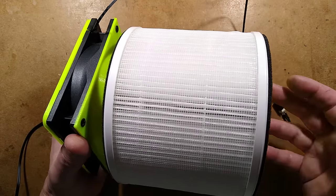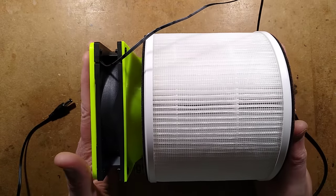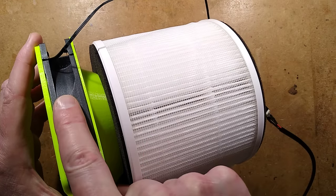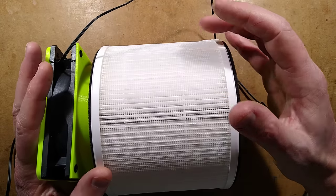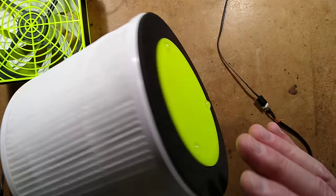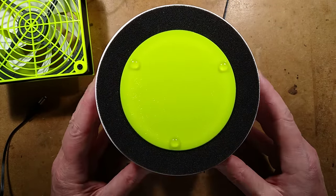At that low power, it's the sort of thing you could have in your bedroom without worrying about the noise, and the filter itself is going to last for a decent length of time — though that depends on how much dust you have in the air. This is possibly one of the cheapest ways to make a fan filter. Even if you buy a super expensive medical-grade filter, the bulk of the components are just the fan and the filter, and replacement filters are normally very expensive. This filter is about £15 shipped — it's actually from a Silent Night filter unit. Let me know what you think of this, make one yourself, but that must be one of the most affordable and compact HEPA filter units about.